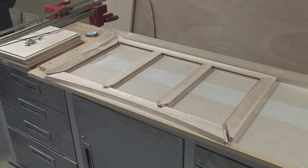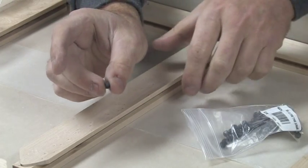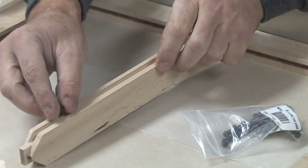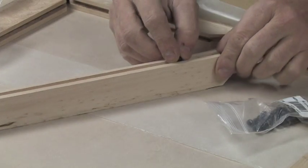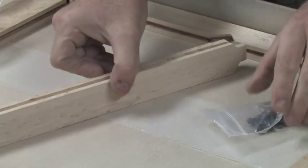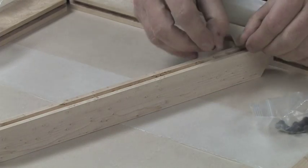At this point, there is no room for error. You'll want to carefully lay out the parts, ensuring that they are properly positioned before applying any glue. We used rubber spacers, called space balls, to keep the panels centered without gluing them in place. This technique allows the wood to expand and contract as necessary, preventing the panels from cracking and splitting as the wood moves. You'll want to insert 2 space balls for each edge of the panels.